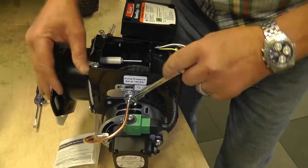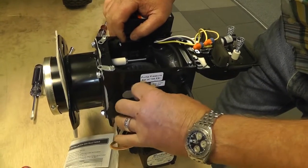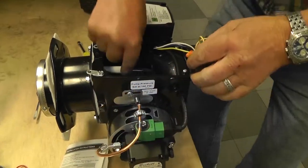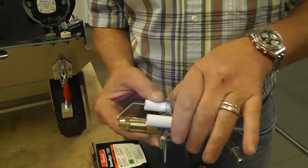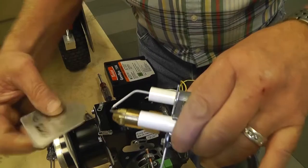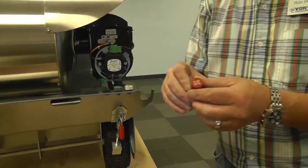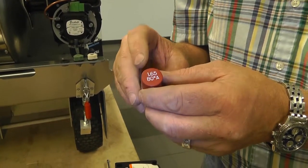We are going to change out a nozzle and look to see if it's dirty. You're going to loosen up this knob first, then take a 7/16 inch wrench and it will take off the fuel line. Normally I'll slide this nut over the top of the fuel line so I don't lose it. Then loosen up this bolt right here — that gives a little access for this to move. I loosen it up and that pops right out. These are your electrodes right here — they will go bad once in a while. On the large unit, the 4000, we are going to use a 2.90A nozzle. On the 3400 PSI version, we're going to use a 1.65 80A.